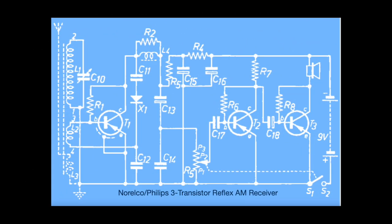Here's the schematic of the EE-20's three-transistor radio. This is obviously straight out of the manual in the kit. I checked the schematic — there's really nothing wrong with it, but there was one error I found: R5 is called out in two different places, though it is accurate. One of the nice things about the manual is that it does have a theory of operation for all of the different circuits you could build, including this one. After reading it carefully, I'm going to give you my interpretation of how this circuit works, step by step.